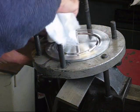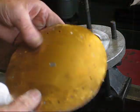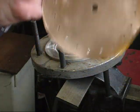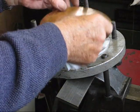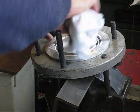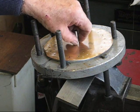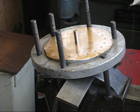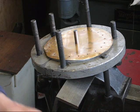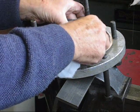All ready for pressing now, having made the holes and deburred. It doesn't look so pretty on the back — I've scratched it on the abrasive paper — but there it is, all ready for pressing. Make sure there's no dirt on your die, otherwise you're going to have holes in your diaphragm. Remember, this material is only five thousandths of an inch thick, so any dirt or little bits of metal picked up off your bench will make a hole in the material. So now we put the rubber discs down.